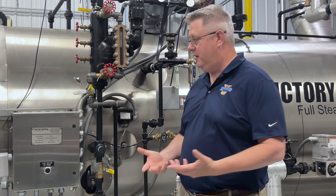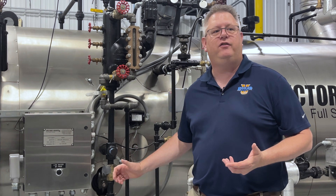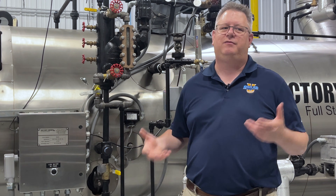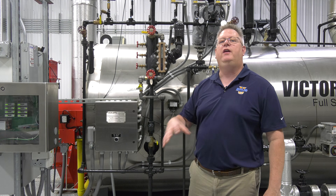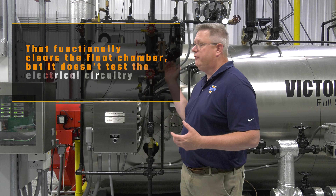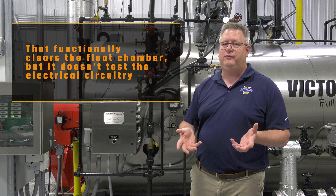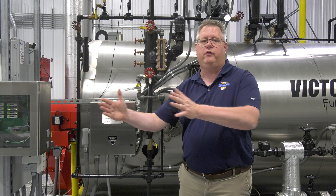The use of a shunt button here allows us to hold that for the duration of the blowdown — plus I like to count to ten — just to make sure that we don't interrupt the operation of the boiler. That functionally clears the float chamber, which is one of our objectives, but it doesn't necessarily test the electrical circuitry.